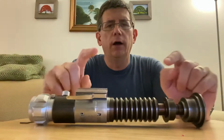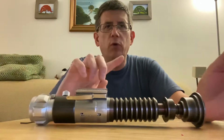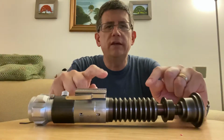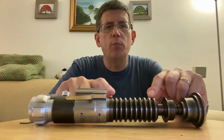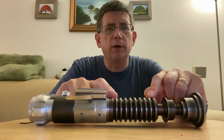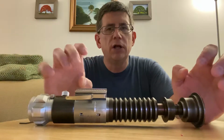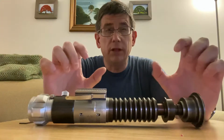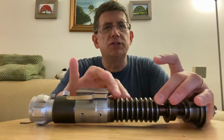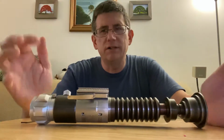to last a while. This has a crystal chamber reveal, and it's going to look very similar to the Mk1 that I'm doing in one of my other videos. It's essentially the same setup for the most part. What I did on this one is, you'll see when I open this up, actually you won't see it, but instead of using neopixels to light the crystal chamber, I used LEDs, and I did that because the LEDs use a little bit less battery than the neopixels do. So I figured it would make the battery life last a little bit longer. And also I ran the crystal chamber lights as a separate blade, so they have their own different color than the blade does. I just did that for it to be a little bit different.